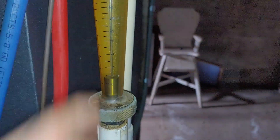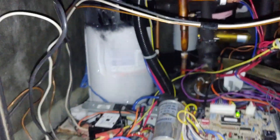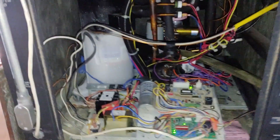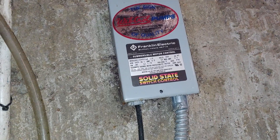Maybe it's frozen up in there, but either way we're not getting any flow. We've got to add liquid to the system or something. Amps are three and a half, and the max amp is 4.4. It does not seem to be moving water at all — maybe a tiny bit. I think our pump is still good. I lifted this up — this is the pack, it's basically a well pump; that's why we have this well pump control. You can see down in there there's hardly any water.